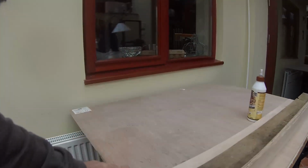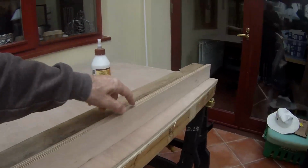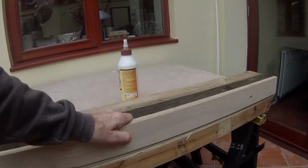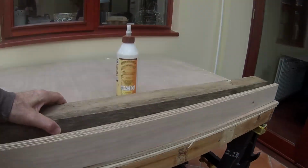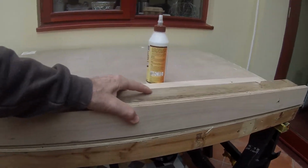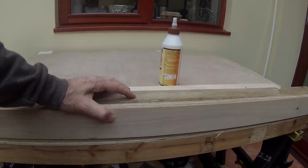I've got to decide which I'm going to use as top and bottom on the boards, and which are going to be the joining edges. But once I've done that, I'm going to mark the middle on the boards themselves, and then I can split them apart and glue them right on the edge. And when I clamp down from top right through to bottom, it should give me a dead straight line. Then I'm going to back it with a fence post, which I'm going to clamp back that way, so I can make sure it's at 90 degrees to the board. Once those are done, I'll do either end, and then I can pop the sides in separately. They're not so important.